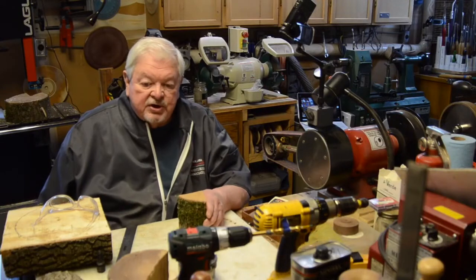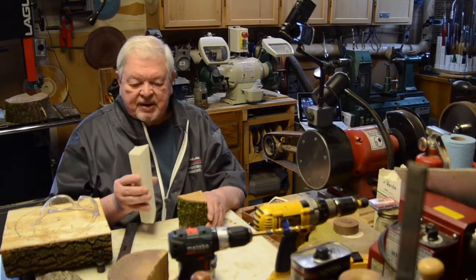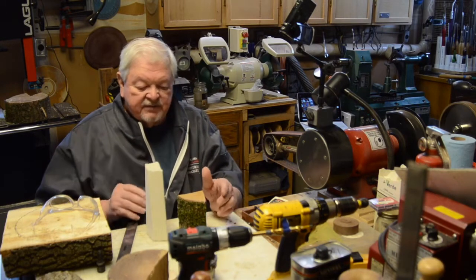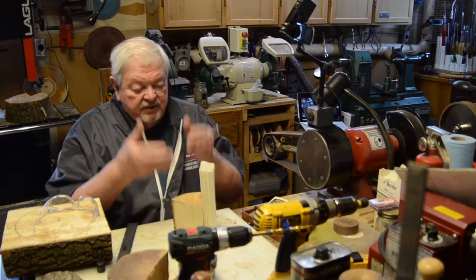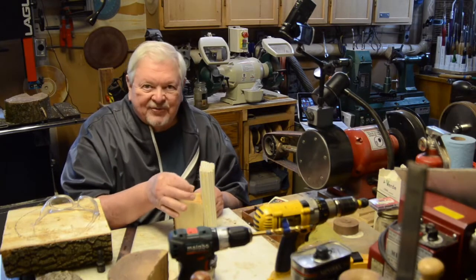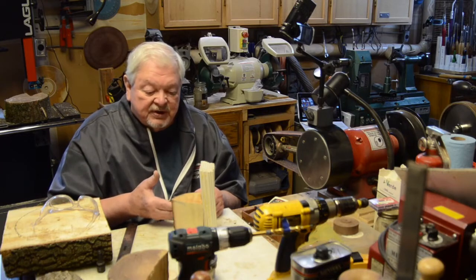I want to cut the little wedge here because I want to talk about how wood moves. I brought along my sample tree. This is soda straws, somewhat indicative of the way grain in wood looks. The tracheids, or the tubes of wood, if we want to call them that, are like soda straws, and they're oriented in this particular direction.